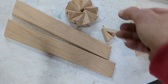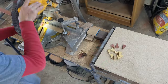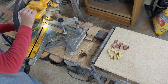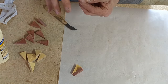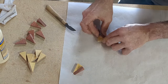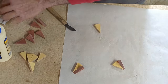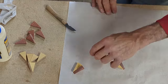We'll start cutting up our material and gluing this up, make our foundation, and move on. Eight segments of each color will get us going on our foundation ring. We'll glue those pairs up on a flat surface. This will give us a nice lap joint that's flush. After gluing these, we'll make sure to remove the spot of glue in the joints that form the 90.